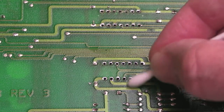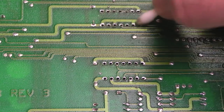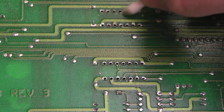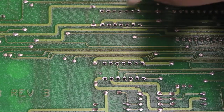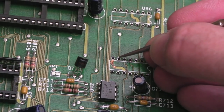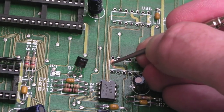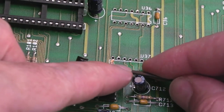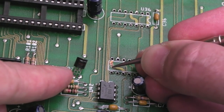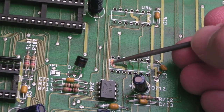That one's looking alright actually, looking sweet. This one - not too bad. No real issues, it's mostly just crusty solder around there that made it look horrendous, although there is the one pin here - the third and fourth ones that have barely got anything left. On the top side we've got some more damage. I've removed a bit of solder with desolder braid, but you can see the ground connection here is mangled - someone levered it at that point and damaged the copper. If I can just straighten out the bit that's folded over, I can just solder on the side and join it back up.